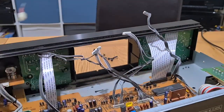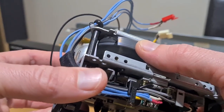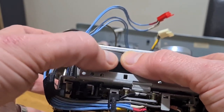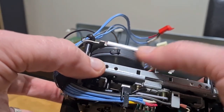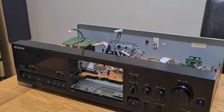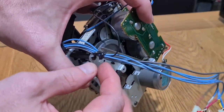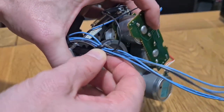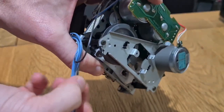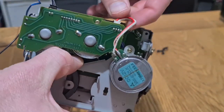The transport is open and needs to remain open. You can see the remnants of a belt — looks like it's half melted, got stuck to the capstan, and someone's tried to turn it on and it snapped. We've got half the belt on the actual capstan and the rest presumably wrapped around the motor. We need to split this — it comes apart into three bits. First thing is to remove this piece nice and gently so you don't snap it, then keep it neat for later.